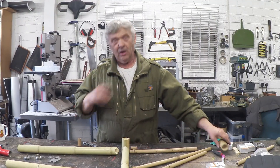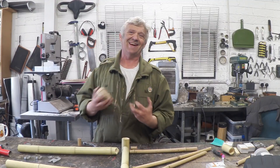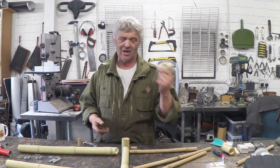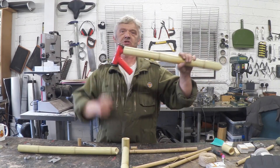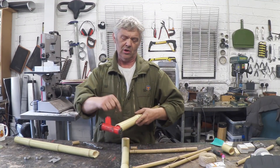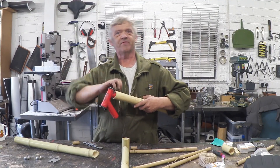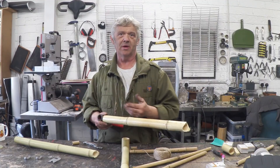We're going to use a lashing technique. There are lots of materials you can use — I'm going to use jute because I like the naturalness of it, but polypropylene, carbon fibre, glass fibre, whatever it is, there's a load of lashing you can use. Essentially, here's the top bar — that bit slots in there, lash it on, that bit slots in there, lash it on, and we've got ourselves a bike frame. To lash it, you drill a hole through here, feed it around and around and around, then go around to prevent that splitting. You won't get that through unless you use a kind of needle, so get yourself a bit of bent wire and poke it through, and you'll be able to lash that up beautifully.